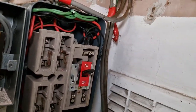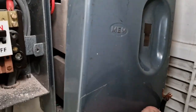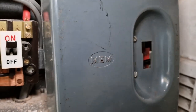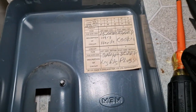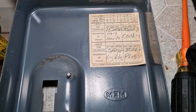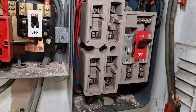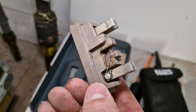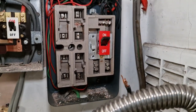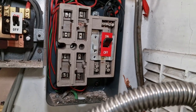Anything that's now obsolete we can just disconnect and make safe. We've got this other consumer unit over here - this was an interesting one because it has a lid on it like this, and you can't actually see any of the breakers - sorry, the fuse wires - without removing this front cover. In there we've got the immersion, cooker, lights and plugs. It's quite a basic setup, but if you do need to get access to replace these fuse wires you do need to be in amongst the live parts, so you switch the main switch off. This is how these things would have been worked on by the actual operator of the electrical system, not just an electrician.